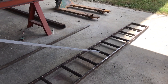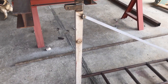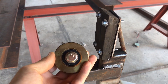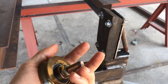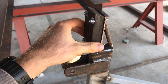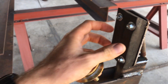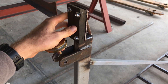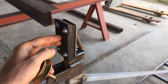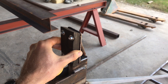So you can see how the ladder is done right now. I did a piece of tubing and added some plates, and here are gate rollers — these already have a bushing so that the bolt fits correctly. And then I'm using an old piece of tractor tire as the braking system. When you step onto the ladder itself it lifts up and pushes the rubber against the cable, and effectively stops it from being able to slide around.